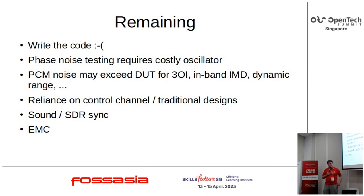And finally, this one: regulators all over the world are doing this. Singapore added it to the amateur radio spec about two or three years ago, and it's the EMC stuff. They're more concerned about emissions than about acceptance, of course, but they do want to hear about both. I have very early parts of an approach to do that. They're looking for ideas for benchtop EMC. You find metal boxes, sometimes called TEM cells, sometimes called reverberation chambers or microwave ovens.